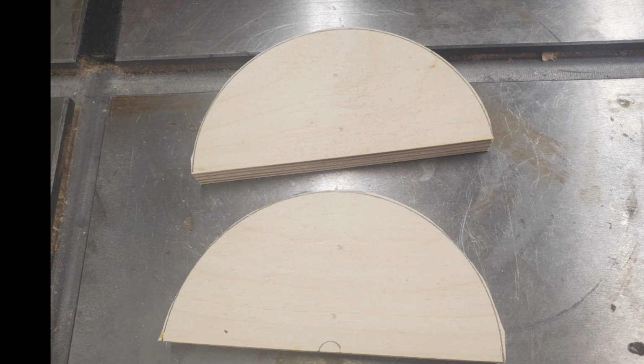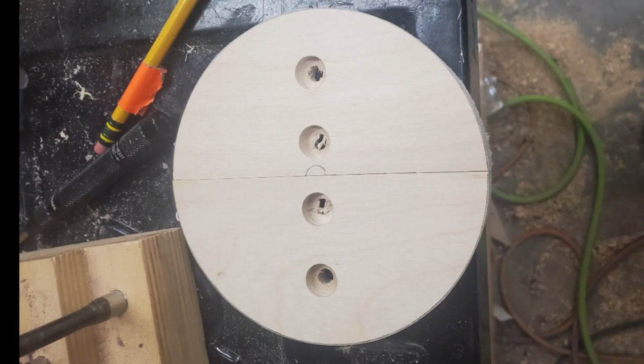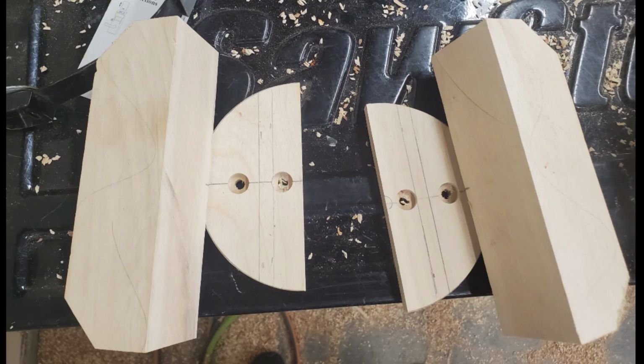But first, sand the plywood to a line. Then I drill the 1/2-inch countersunk holes. Then, using the center of the first drill, drill the smaller hole. If you reverse the process, well, trouble, Will Robinson. Then cut a 2x2x8 piece for the upper section of the jaws.